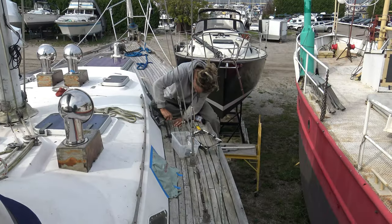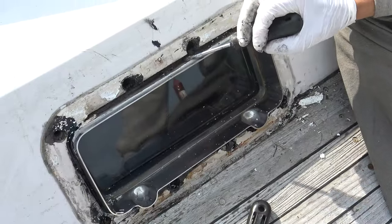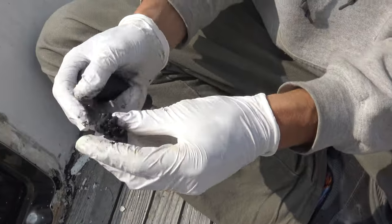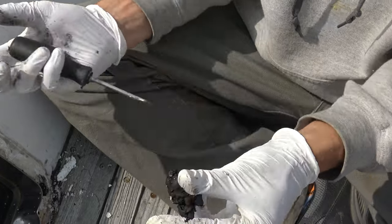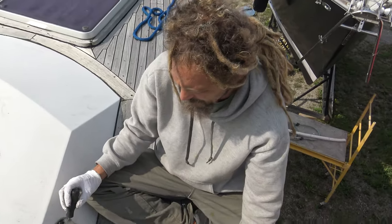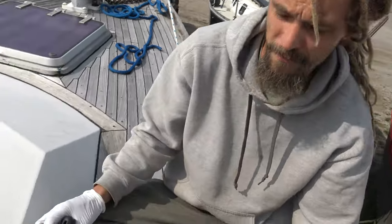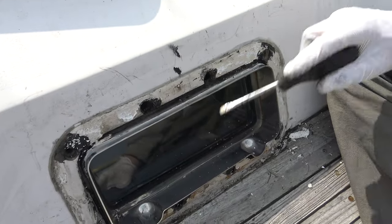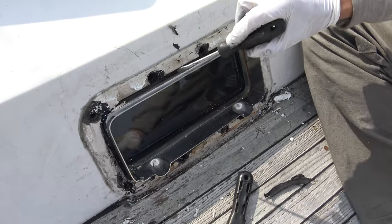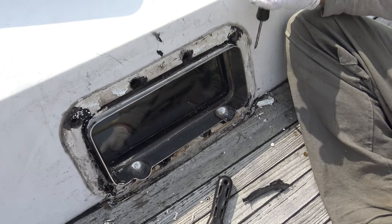She's finally asleep, so I can work. Corey's doing this window because every window is going to come out pretty much. This window we're lucky to have three different sealants. There's this butyl rubbery gooey stuff that's been giving me tons of trouble to get off, but luckily once you scrape off most of it you can get rid of the residue with almost any solvent. There's also 4200 and my favorite thing ever — silicone — which takes forever to clean up.